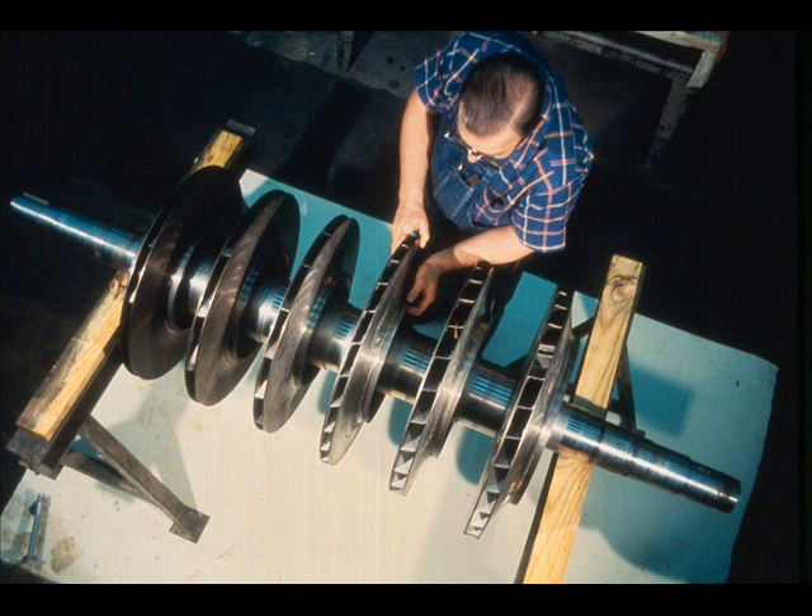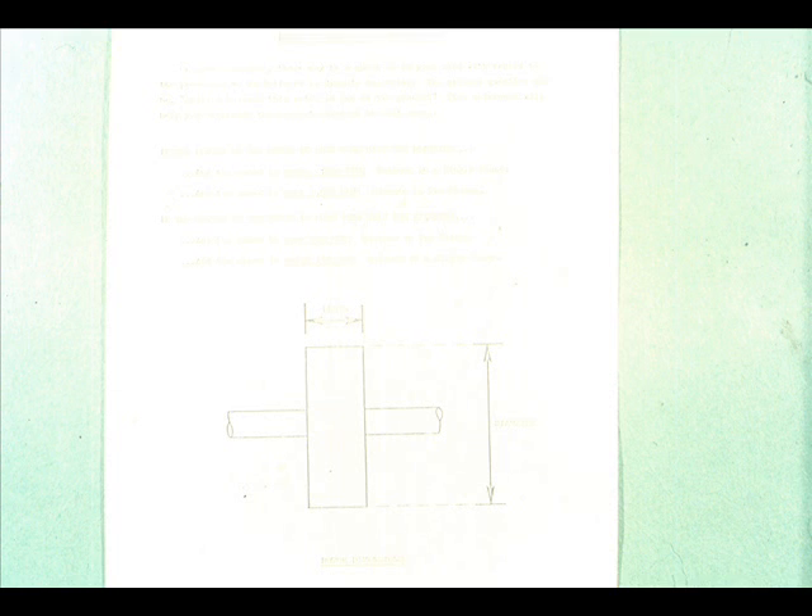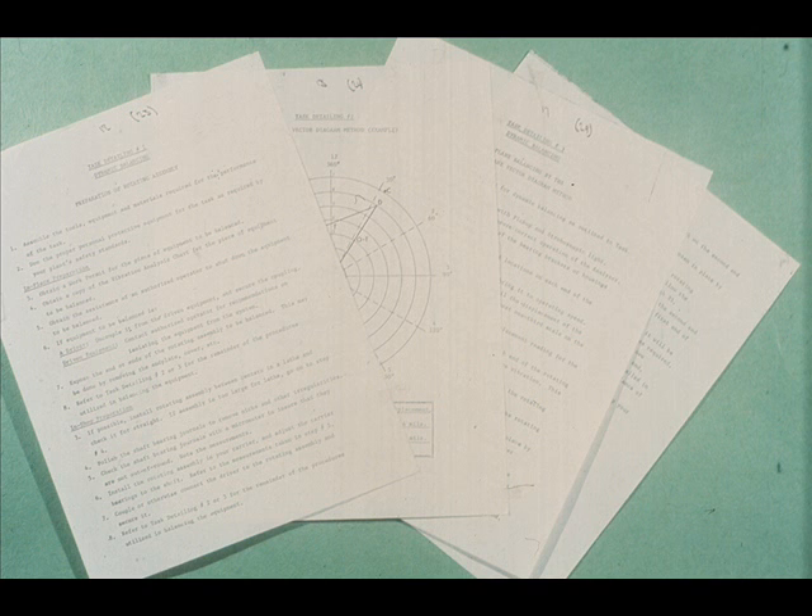Once you've become familiar with single and two-plane balancing, you will undoubtedly be expected to go into multi-plane balancing. This is an advanced type of balancing that requires a great deal of experience and application of knowledge acquired through the simpler forms of balancing. There are a number of references in your workbook which can be of tremendous help in your skills lab sessions. One reference is designed to assist you in determining whether a rotor should be balanced in one or two planes. Another reference contains detailed instructions on situations where you are unable to install a correct weight where the formula says you should — in short, you have to divide the weight between adjacent points on the rotor. There are also references which break the balancing procedures down into a step-by-step process with examples included. If you have any difficulty with them, ask your instructor.